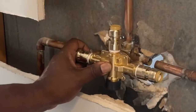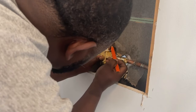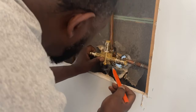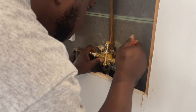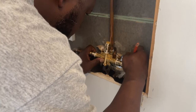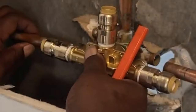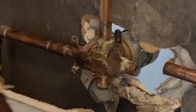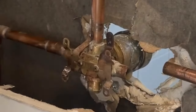Although I've already cut the hot and cold supply lines going to the valve, I now need to fine-tune exactly where I need to cut all three pipes — the one going to the stem for the shower, the cold supply, and the hot supply. Rule of thumb for half-inch copper piping: you want that pipe to go into your SharkBite fitting about an inch — technically 0.95 inches, but we'll just say an inch. Of course, you want to cut off your main water supply before you cut your pipes.